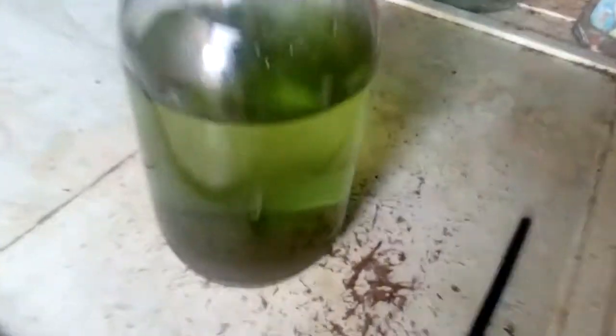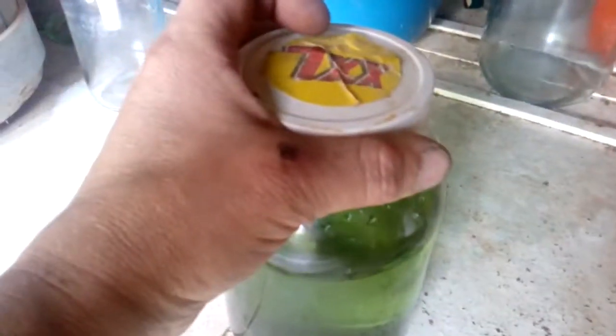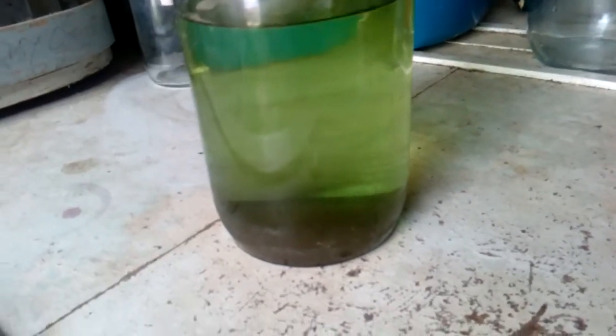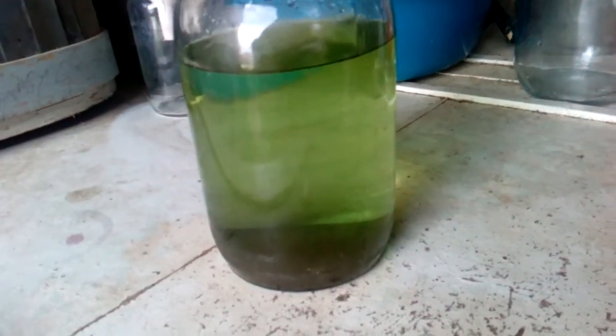This is just after half an hour — you can see my solution is already saturated, and look at that gold button. It's clumpy and it settled down after 30 minutes. We got some base metal in the solution but it looks like good quality gold. When you get that fast dropping, it's a good quality gold. I did a stannous test from the solution above to see if any gold was left, and you see there is no reaction at all — so we dropped all the gold. Just to be safe we left it for a couple more hours, then we will filter this.